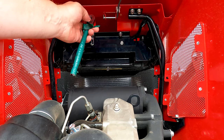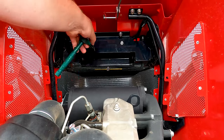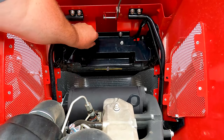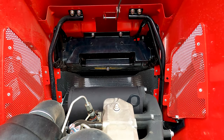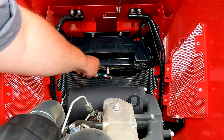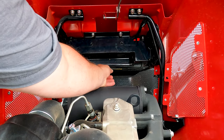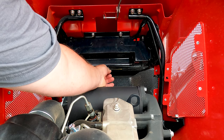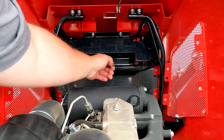10 millimeter for the top two bolts, 12 millimeter for the bottom bolt. I'm resting my hand — I think this is on the manifold — so that would be hot if this tractor was on for a while. So again, make sure everything's cool.